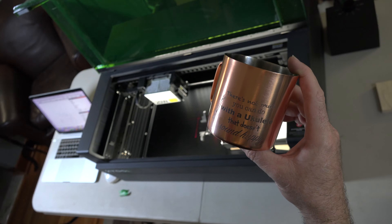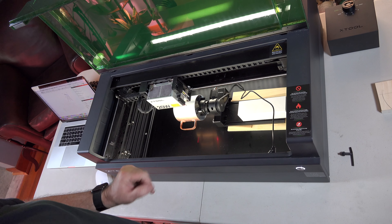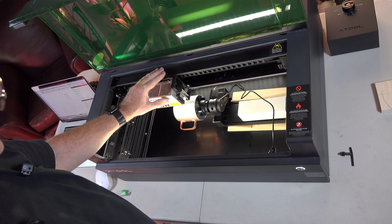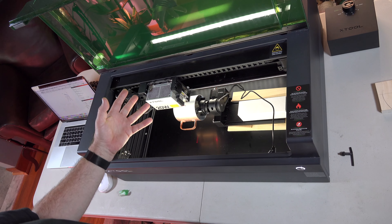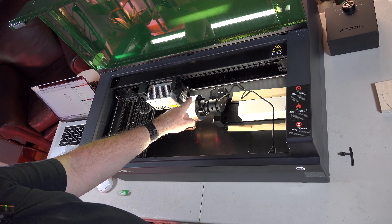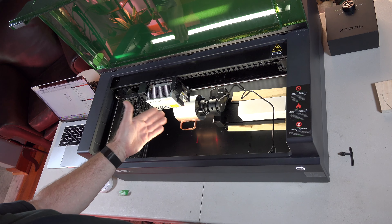The actual engraving worked out well in spots where the spray didn't get messed up — I got dark engraving in those areas. The problem was the rotary setup and being in the way. I'm going to redo the setup using the smaller chuck arms. It's the next day and I've changed the configuration of my jaws to have everything completely on the inside of the mug. I did some research about the laser pointer offset and it appears there may be a compatibility issue between the S1 and LightBurn with the rotary. So I've aligned the actual laser head with the center of the mug after focusing. Let's frame this out and give it a test engraving.